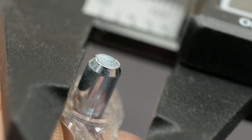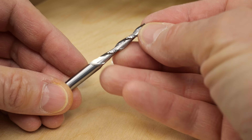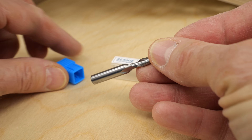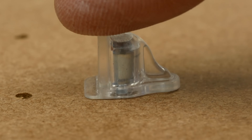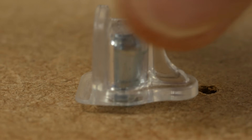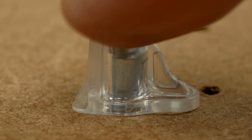When it comes to the shelf pins, there are a couple of things to be aware of. Although shelf pins are typically referred to as 5mm, the majority I've come across are actually 4.76mm, or three-sixteenths of an inch. So if you're using the same 5mm loose tenon bit for the shelf pin holes, you'll likely find that the shelf pins are all a little bit wobbly. Because of this, I recommend using a 4.76mm bit for the shelf pin holes — there's one included in the Starter Pack Plus, along with a 5mm bit and a small pack of 5x30mm dominoes.